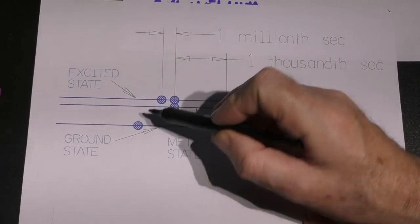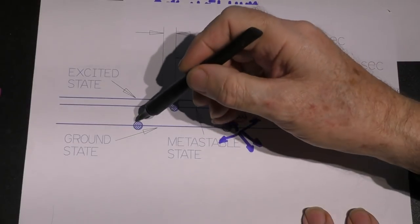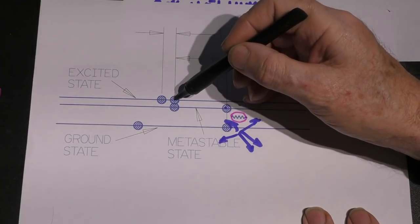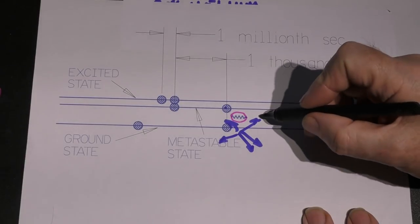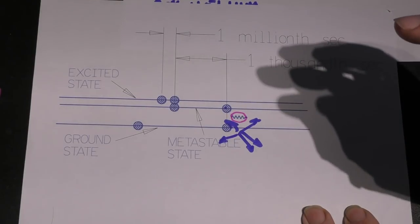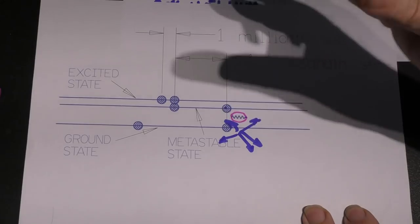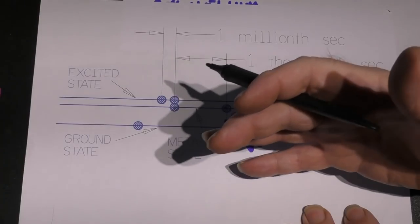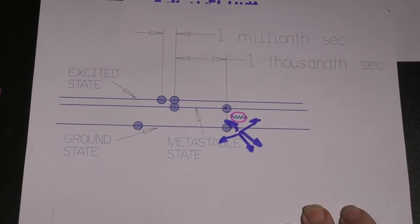One of the electrons within the CO2 molecule receives a little bit of pink energy from the nitrogen and that knocks the electron up to its excited state — the next orbit — where it stays for a short period, drops down to its metastable state, and then falls back to ground, emitting an invisible 10.6 micron wavelength of infrared light. Something you can't see. And again, it will be totally random — there is nothing to say it must go in a particular direction. It's very low random density, so it's not going to harm you.